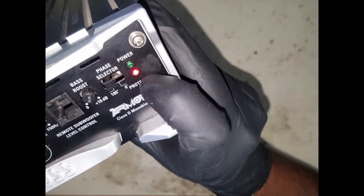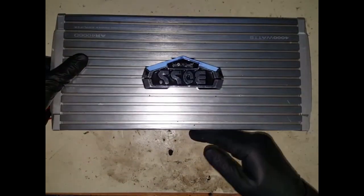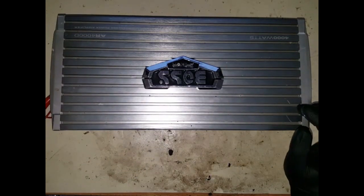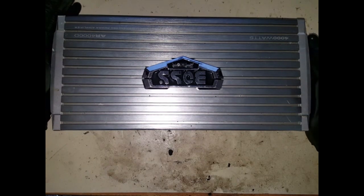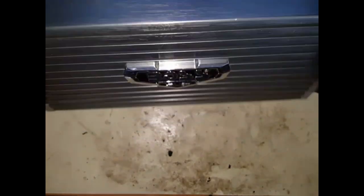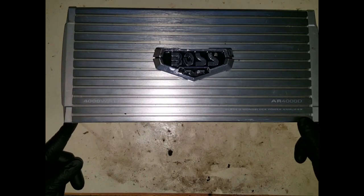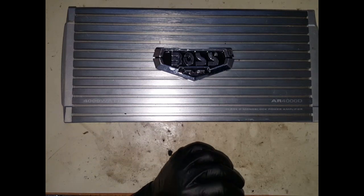All right, so let's figure out what's going on. Okay, this is heating up quite a bit on the sides. Let's turn the power off and remove my leads. Okay, so it was taking about 1.35 amps. So let's disassemble this and pull the motherboard out, and let's begin with testing and see what the issue is. I'll pause, disassemble all of this, take the board out, position it here, and then I'll come back. So bear with me.